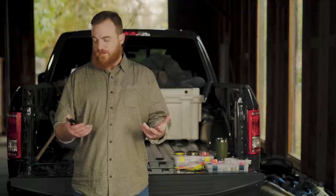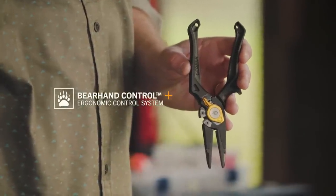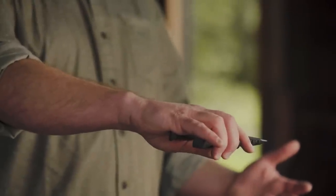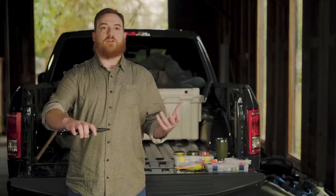Because we decided against any sort of rubber overmold, it was up to us to optimize the shape of the handles so that your hand would actually interface them and engage them positively. I learned from my days as a motorcycle mechanic and a motorcycle rider — if you set up a brake to engage a little bit farther back towards where your hand is making a fist, you're really taking advantage of the strength of your hand, and that results in a lot more control.